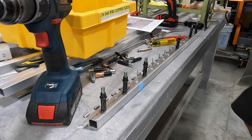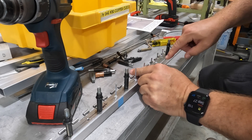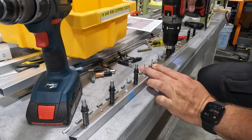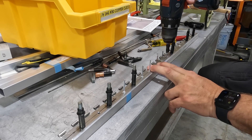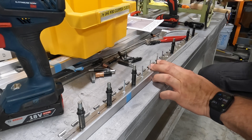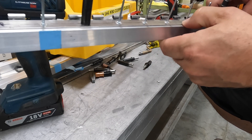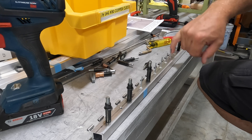Let's walk through how we do one of these holes. Here I've got a hole that is not ready for rivets yet. We take our countersink bit and drive that in a little bit to get the hole started. Clean up the hole with our standard drill bit, and then clean up with our deburring tool. Drop the rivet in — we're pretty close. We just need to fine-tweak each hole to get it to be slightly under the lip of the tube or the hinge.